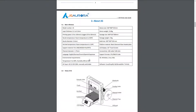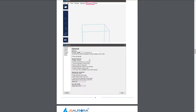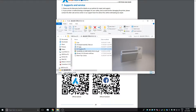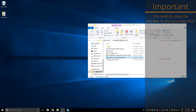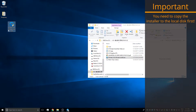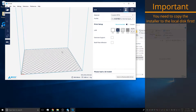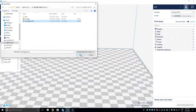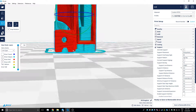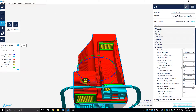The 16GB USB stick contains a user guide that tells you how to install and use the slicing software, as well as some safety information, an assembly instructions video, some pre-sliced models, a model of the fan duct so you can print it later, two old Cura versions, and their own software JGCreate — which is a more modern version of Cura but with their own printers pre-configured. I ended up using this slicer for my first prints and it's really easy to use. On first startup you select your machine, add your model, and adjust the settings. Finally, don't forget to export the G-code file.